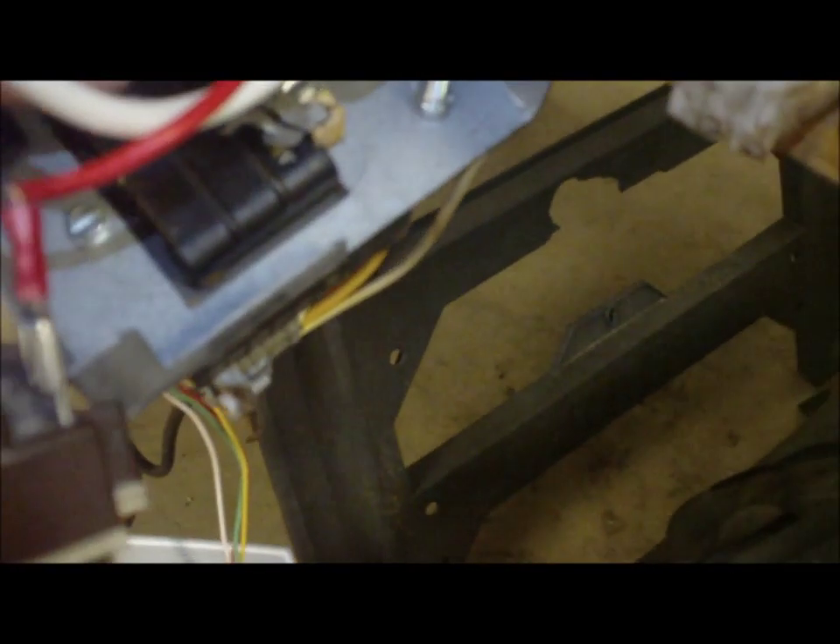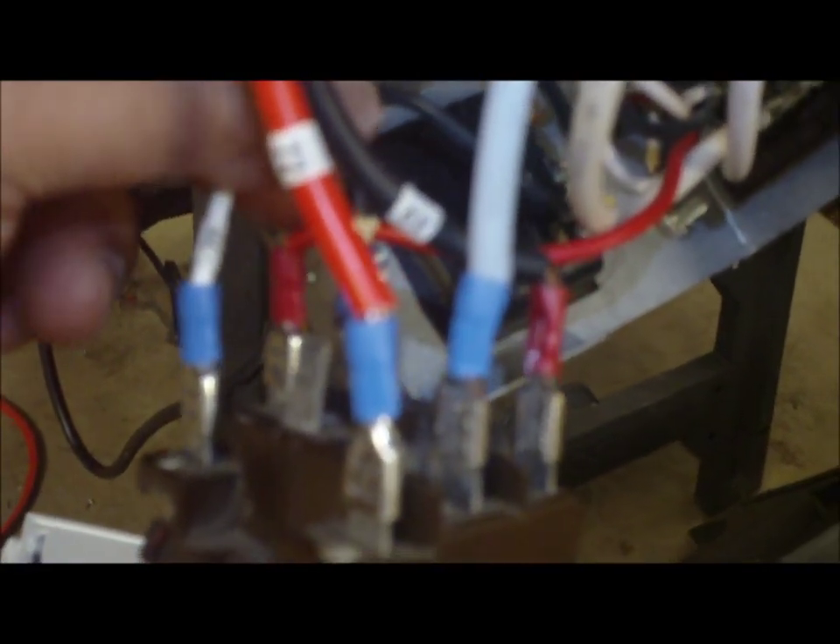It comes out and you can see there's two black wires spliced. One of them goes to your door switch right here, and the next one goes to the primary of your transformer at 120 volts. There are two wires connected here — one black wire goes to this 8-pin relay. This is considered a two-pole relay.